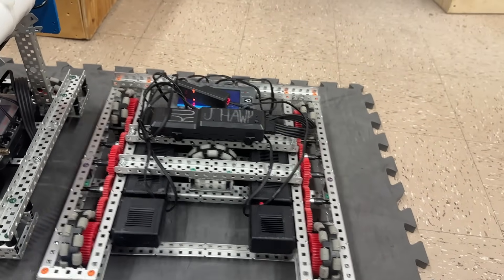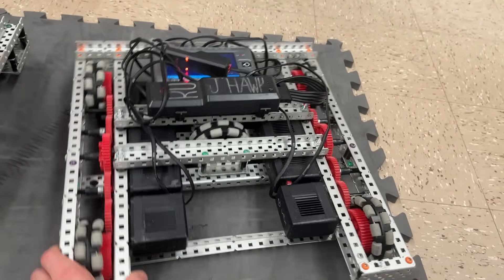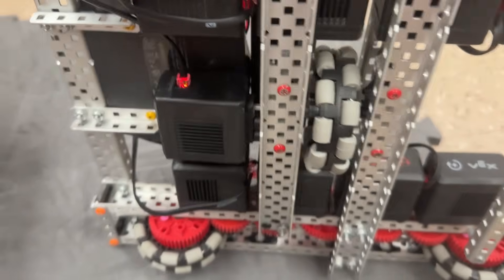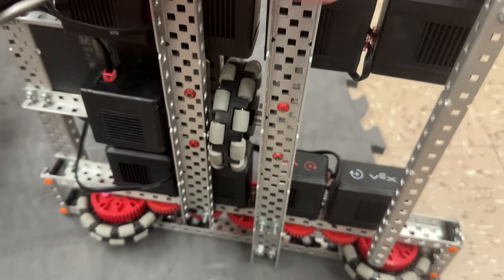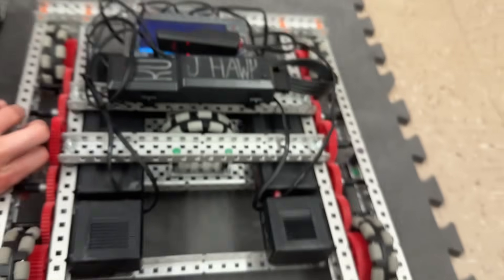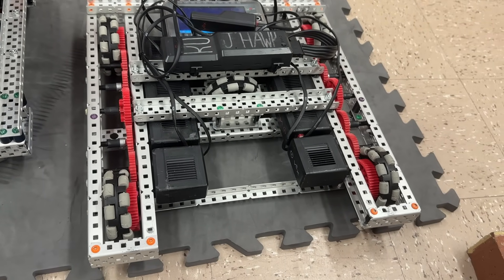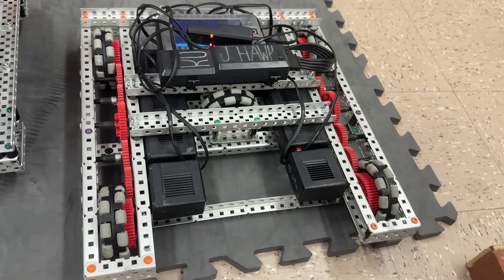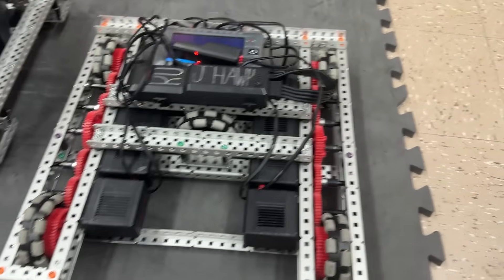There's not really a whole lot of benefits to running an H-drive. It's a lot of extra work, getting the spacing in there is awkward, it doesn't really give you much extra maneuverability, and it has a high motor cost if you're in VRC. So if you do want to run holonomic, I would probably recommend doing a mecanum drive. If you're dead set on holonomic, I like X-drive probably a little bit better than mecanums, but I've also used them significantly more. If you guys have any questions, be sure to comment them below, and be sure to like, comment, and subscribe to please the YouTube algorithm — I'll see you in the next one.